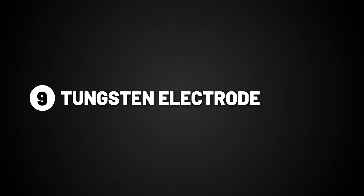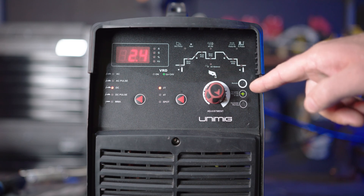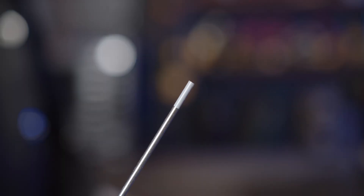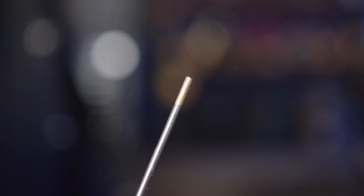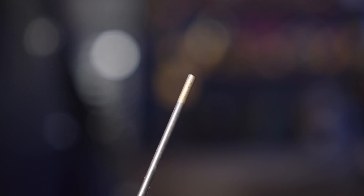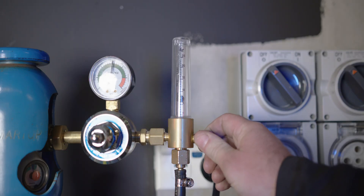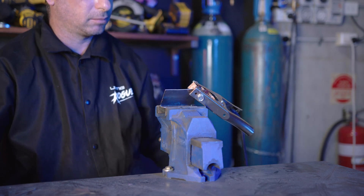Part 10: Tungsten electrode. You'll need to choose the thickness of the tungsten electrode you're using. We supply four types of electrodes: the grey tipped ceriated, the white tipped zirconiated, the purple tipped E3, and the gold tipped lanthanated. We'll be using the gold tipped lanthanated as it's more versatile and has better arc characteristics. Now that you have set your parameters, turn your gas on to about 8 to 10 litres per minute and attach the earth clamp to your workpiece. You are now ready to weld.